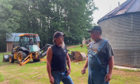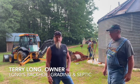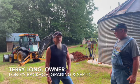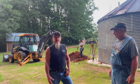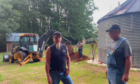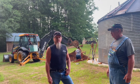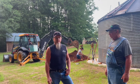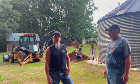So tell us sort of what you've got going on here, Terry. Well, first of all, we had to do some test holes out here to make sure our ground was acceptable for our drain field. And next, we've got a 1,000-gallon septic tank coming. Ladies are digging a hole right now for it. We'll get it in the ground and get it plumbed to the building. And then we've got 80 foot of drain field we're going to install for the sewer water to go into once it leaves the septic tank.